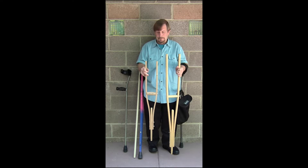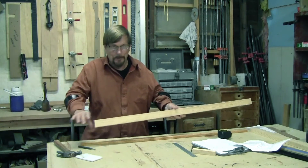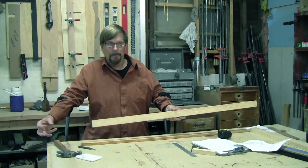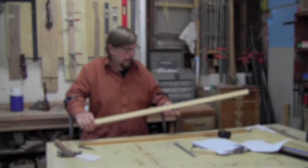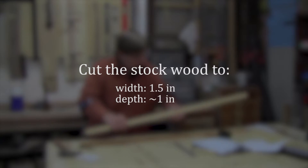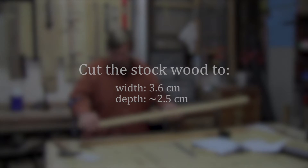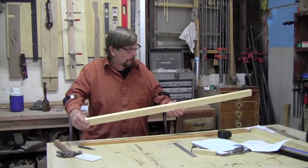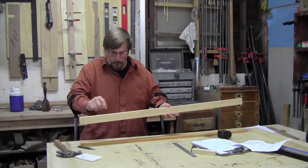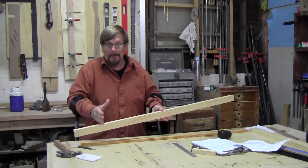Kenny crutches — how to measure. The two bows of the crutches are what we're going to make next. The bows are the two pieces that run on the outside of the crutch, as versus the leg, which is the centerpiece that you put the crutch tip on. So we take our stock and cut it down to be one and a half inches by an inch or thereabouts. Now we want to take these two pieces whilst together and drill our through-holes — this way when we drill one hole through both pieces they're going to line up exactly.